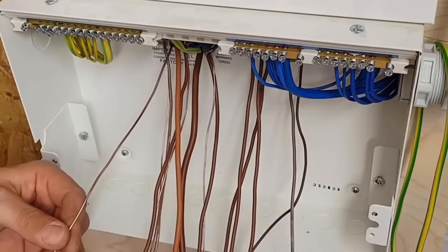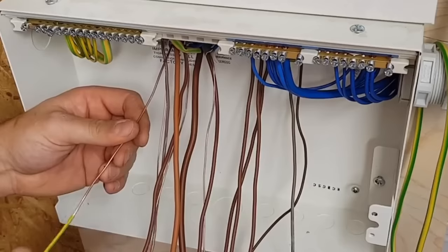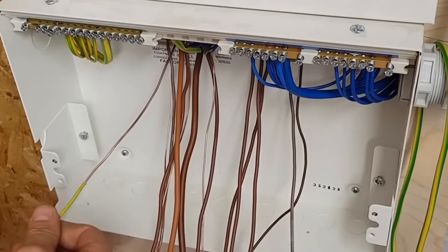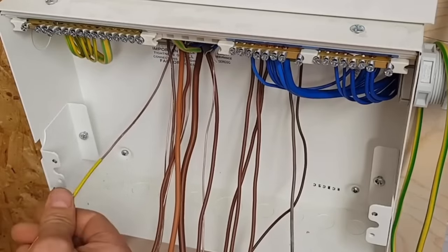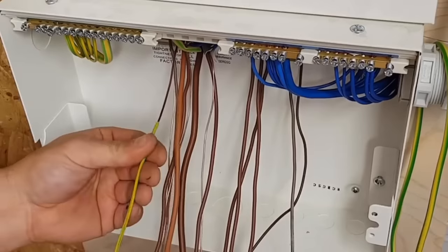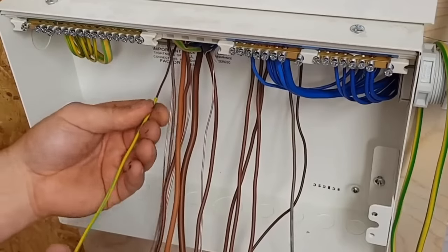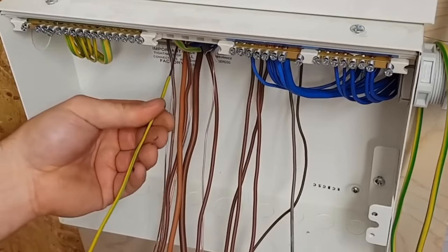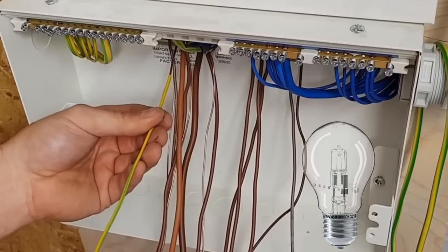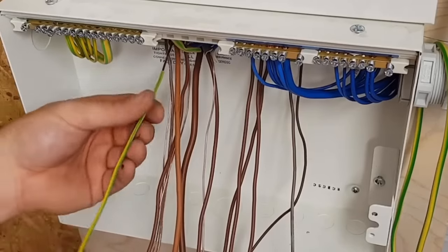Am I right in thinking that some of the early retrofit app-controlled light switches needed a neutral at the actual switch themselves? Oh, I know what you're saying, all the Wi-Fi stuff. I'm going back a few years, there was a big push to just drop a neutral down. Some of them, before the LED came out, you could actually use it, because going through a bulb, a lamp, there was a bit of a pull on the switch line, so that was enough to almost use it as a neutral in some of the old lights. But because of LEDs, they don't have a lot of load on them, so that doesn't always work. You end up with the LEDs flickering.